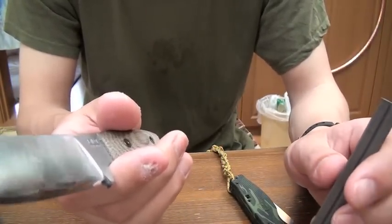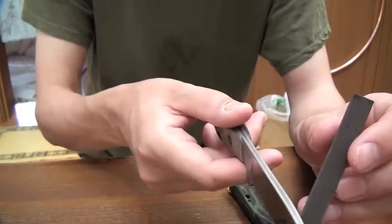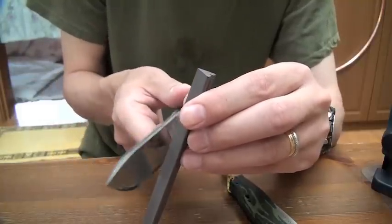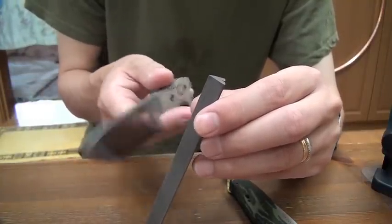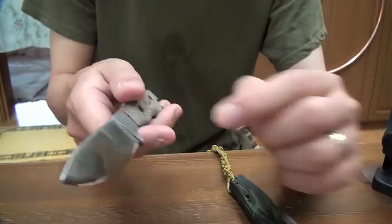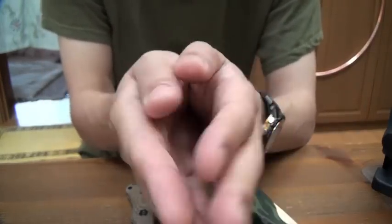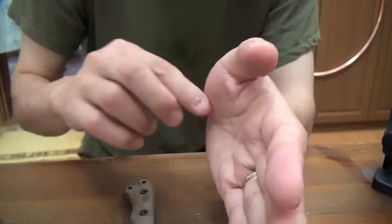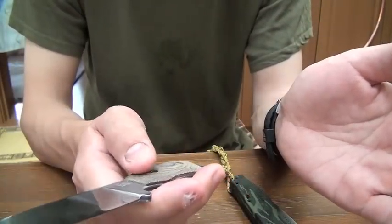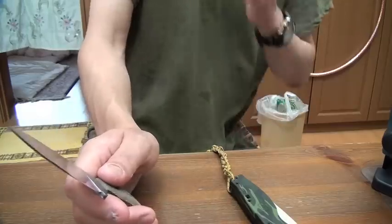I said this steel is brittle. That might be wrong, in high probability. I used this diamond rod in a hurry with might. This system touches the edge at just one point, this angle. So very strong power is added from this point to the edge. So the edge took much power, right, left, alternately, and the crack took place and looked brittle, and the edge was ruined. That was the correct story, I guess. And I'll test from now.